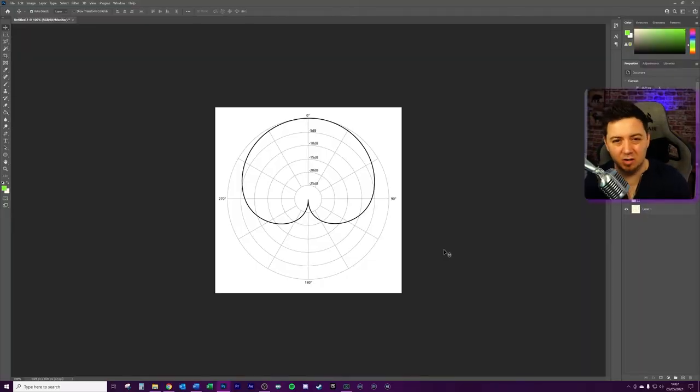To illustrate — this is the cardioid polar pattern. You're expecting to take sound away from the back and pick up more and more frequencies as you get towards the front of the microphone. Even at 70 and 80 degree angles on either side, you're still getting massive amounts of frequencies coming through. So if I'm coming at the microphone from a slight angle, it shouldn't make much difference to the audio pickup. In my experience, it was more like a narrower pattern, which means that when I'm moving around on stream, even coming slightly off-axis has caused inconsistency of sound.